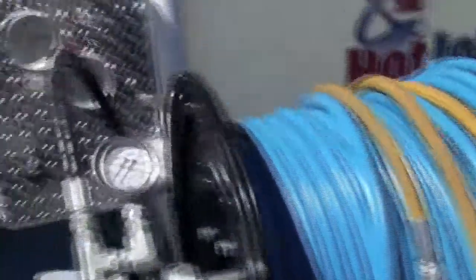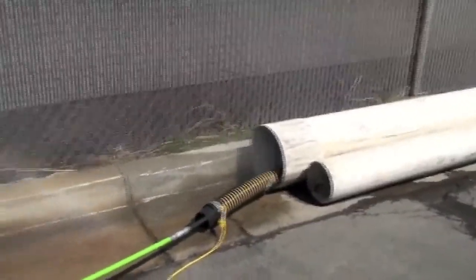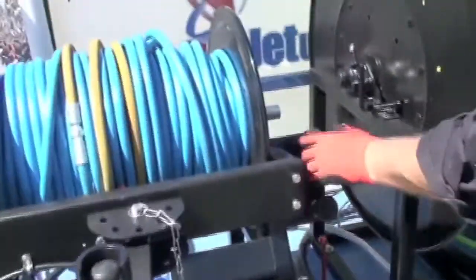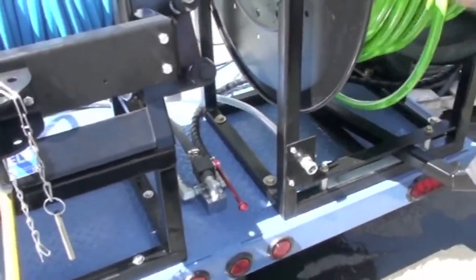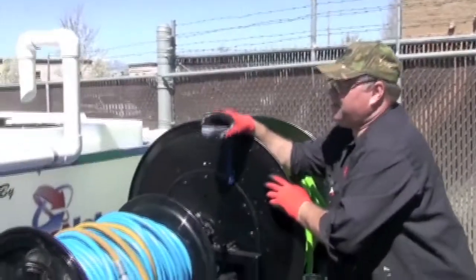Then we can throttle up. Then go ahead and press the second engine. To shut down: turn on your easy start valve, turn off your main valve, throttle down, now you can turn off your engine. Hit the stop button and it kills both engines.